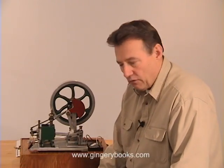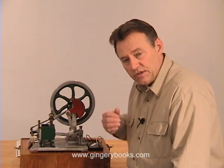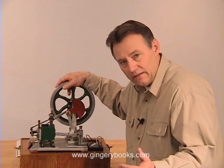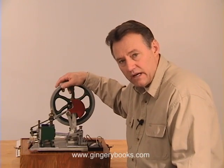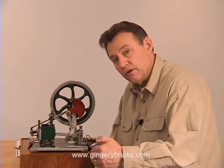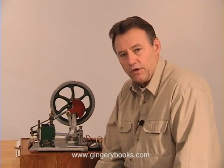This engine, just like the differential engine, is able to complete all four strokes in a single revolution of the crank. This engine does not have a separate camshaft or separate timing gears to make this possible — all the cams are located on the actual crankshaft itself. This is very unique. Whereas the Otto engine did the same thing but took two complete revolutions of the crank.